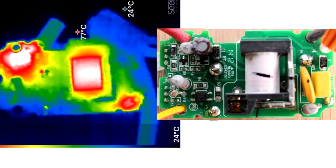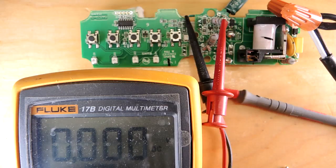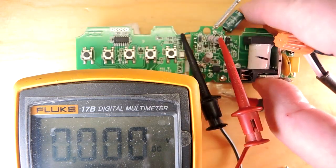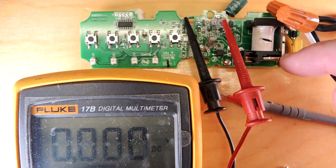If we look at this thermograph, we can see the hot regions of the board. Let me insert the circuit board diagram so it's easier to locate what we're looking at. There are three regions of significant heat: a resistor near the AC power section, the coil itself getting fairly warm, and a resistor right next to the actual capacitor that failed — reaching a significant temperature, and this is just with the timer waiting for someone to press a button.